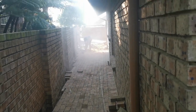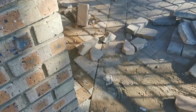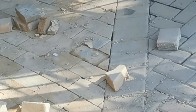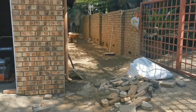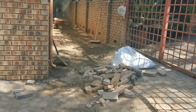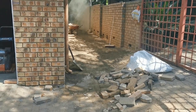Lots of dust! Andres is cutting the bricks to make them fit so we can finish the paving. As you guys can see, these bricks have been cut very nicely — all the sizes are fitting into the small spaces that were left, and this guy is really doing a wonderful job. He's putting river sand on top of the bricks and brooming it into the grooves to make them fit more tightly.